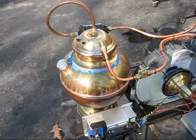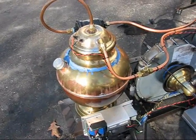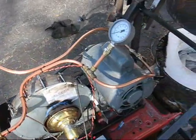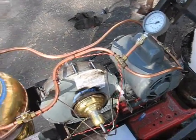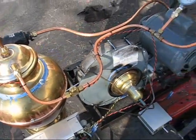This is simply a gas tank. Inside is a fuel injection pump from a Nissan. There's a fuel filter, and the fuel passes around in a complete circuit to give some flow to cool the pump. The pressure is set just with this valve here that blocks some of the returning gasoline.